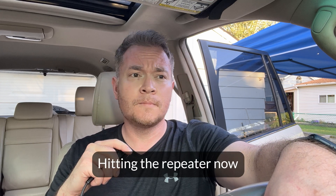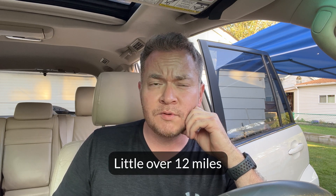All right, got the elbow replaced. Let's see if this works — see if I can at least get the repeater tone. N9JDI, can I get a signal report please? N9JDI, N9IJS — how's it going Tom? I'm not in a position to speak for much here, but you are coming in. It's a little staticky, not quite full quieting, but fully readable. All right, that seems to have done the trick for the time being. Still a little noisy according to the signal report — I'm about 15 to 20 miles from this repeater. But the radio's not toast, so the rain did not kill it. I am so happy to report that. I lucked out, I guess, just letting it sit for a couple of weeks in some desiccant to dry off. Maybe it wasn't damaged too bad to begin with, but the FTM 300 apparently can get rained on with a sunroof open and function well.